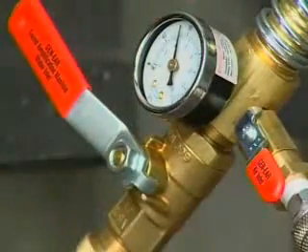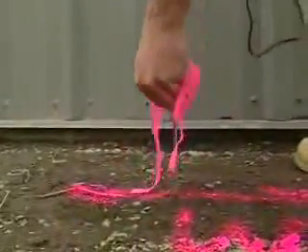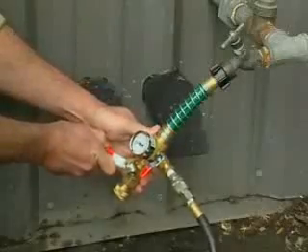To be safe, shut off all fixture and water heater valves. Turn the compressor on and open the air valve on the SAM. This will amplify the leak noise during the leak location process. Once you've pinpointed the leak and marked its location, double-check your mark by turning off the air valve on the SAM while listening to the marked area.